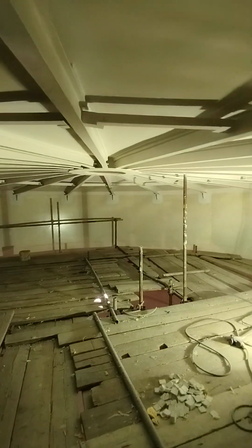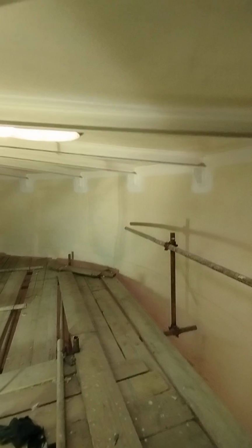This storage tank was covered with solvent-free epoxy paint, but the problem here was that the inspectors had no idea of the corrosivity of demineralized water, and they forgot to inspect the areas where two parts of the body meet each other. There we had a gap, and also here we had gaps.